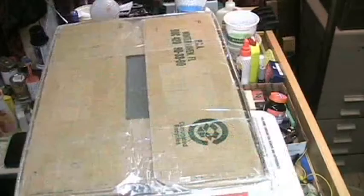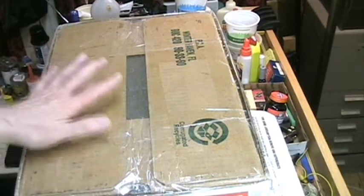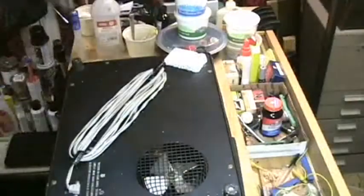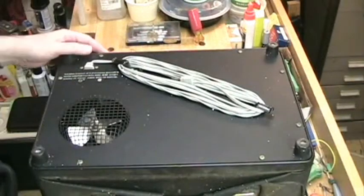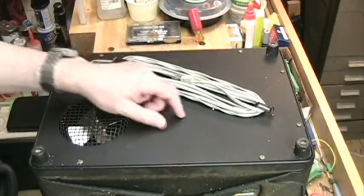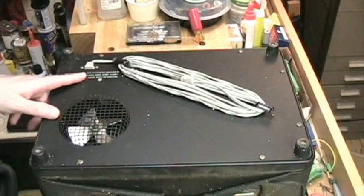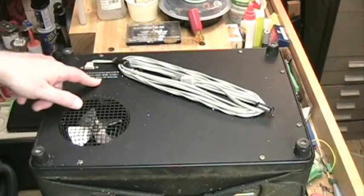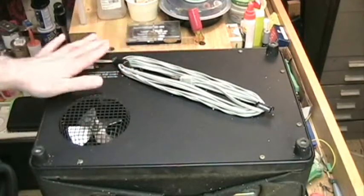This is Robert's original packaging. Here's a tip: because this is packaged so tightly in the box it's hard to reach in and pull it out. So what I've done is I've turned the whole thing upside down and now I can lift the box right off the tape recorder. We're looking at the underside of it. There's a little bit of white stuff from the styrofoam. We can see that the bottom plate is removable by screws located here. It says that this cover is provided with an electrical interlock. This is obviously a tube-type machine — in the old days you used to take the covers off to replace the tubes, and to make it safe they put the interlock on.